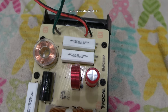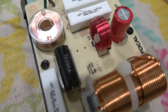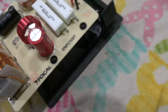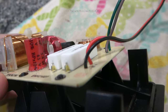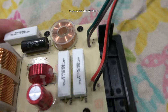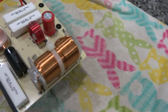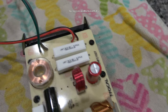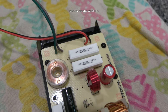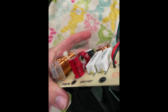It's getting hard for me to find good things to say about the Focal 906, and I'm really trying. I don't want to bash the brand because this channel is about informing consumers on what they're getting for their money. Frankly, I'm really disappointed in what $2,200 gets you from Focal. So far, the MSRP and the quality of construction is more in line with speakers costing around $1,000. Looking over the crossover components, I see a tiny air core inductor and poly cap on the tweeter circuit, and an iron core inductor and an electrolytic cap on the woofer circuit. The Aria 906 would benefit tremendously from a crossover upgrade. Focal put a very nice mid-bass driver in these speakers and then handicapped it by using all of these poor crossover components. What a shame.